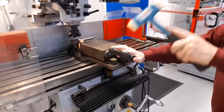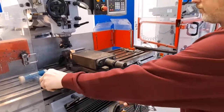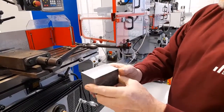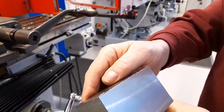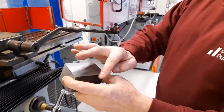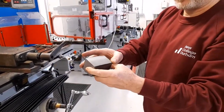The finished face of the workpiece can be seen, and I'll now remove the workpiece from the vise. As you can see, there's quite a substantial burr on this edge. This means that in between each operation, the face which has been milled should be deburred before moving on to the next part of the operation.